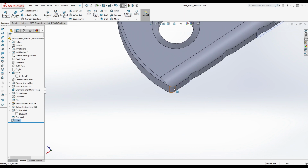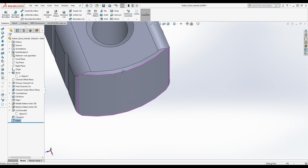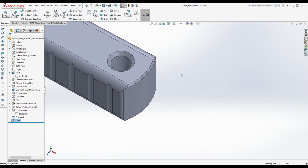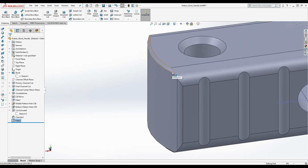Because this is an easier thing to do when you're milling the side, right? That's easy to do. This is easier to do for a chamfer. To do an actual fillet slash chamfer on a curve, like a 3D part like this, you're talking way more complicated and actually way more machining time, which is why I was like, I don't know that he did it that way, right?